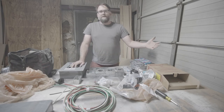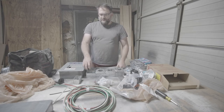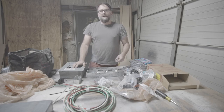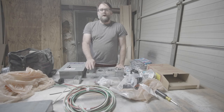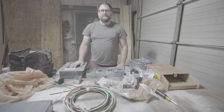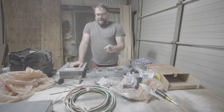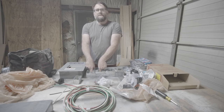You don't want to draw everything off of one leg and nothing on the other. You'd like to ideally plug into both. So you're going to steal one of these plugs if you're plugged into stuff. For now, until you get your transfer switch, you can just run your cord and plug it right into this and have the generator running. Later, we'll probably just always have something plugged in here which goes to a transfer switch. But if you have somebody plug into number two, when the generator is running, it'll sort of equally load these two because you'll be pulling off the two legs.